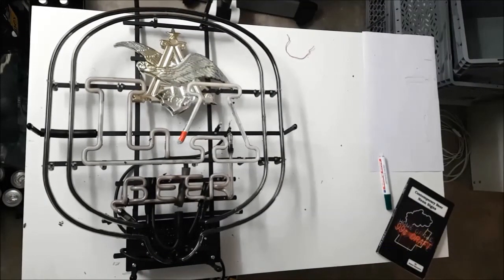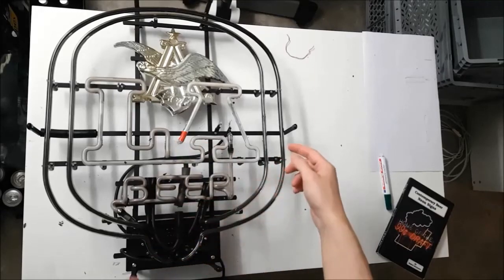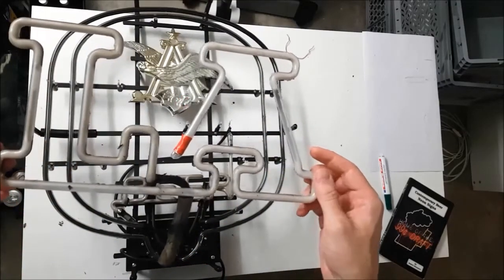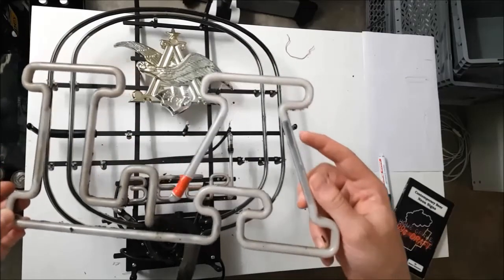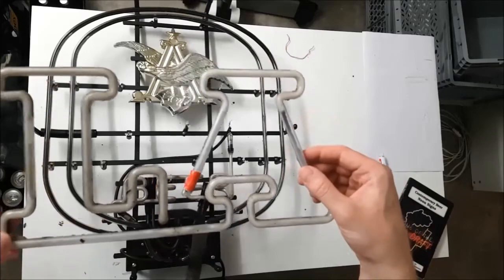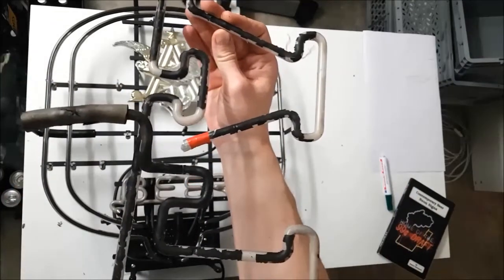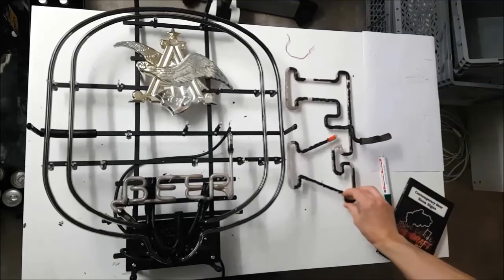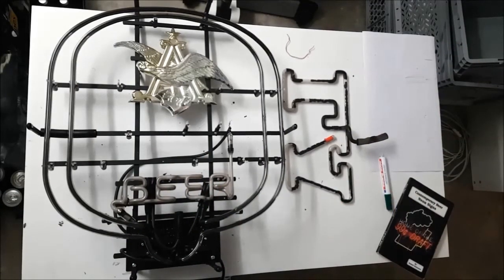So I have shown you repairs of clear red tubes before, but this time we have something new because a blue tube broke, and because this tube has contained a small amount of mercury, so it's not the healthiest thing to repair, and also because the phosphor has blown off in some areas when the tube broke. I'm going to completely remake this tube and take you through that process. I have a second camera now, so we should be able to get some good footage of the workshop, the fires, as well as the bending table.